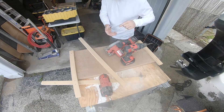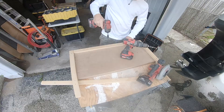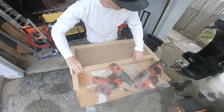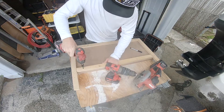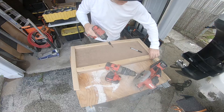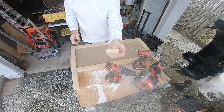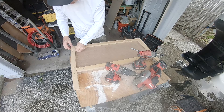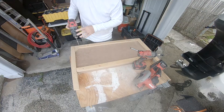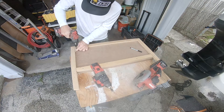So these are one and a half inch wide pieces of MDF that I cut perfectly square and I'm screwing them around the outside of what will be my mold. I'm going to be using these as a guide for my trim router with a special trim router bit that I purchased just for doing this. Here's a little corner piece that I'm going to throw in here — this is going to make an angle on the edge of the mold for water drainage. You'll see how this all comes together later in the video.